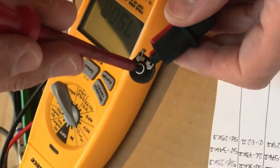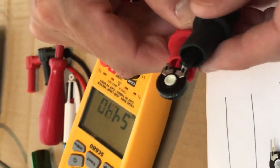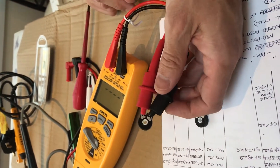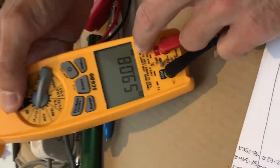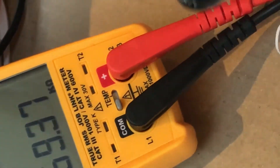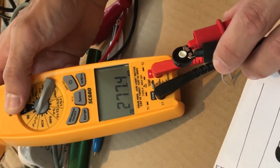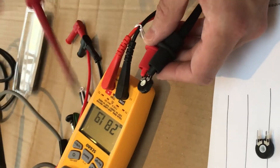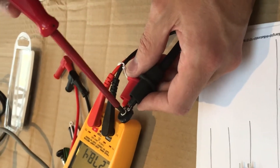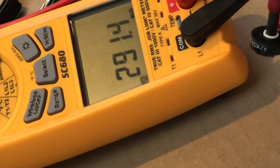I'm going to move it around a bit. First of all, we'll have a look at what we get from A to E — this should be a fixed resistance of about 47K. We've actually got 59K — you can see that, 59K there — that's across from A to E. Now the tolerance of the new one is 20%, which means you can go up to 56K. This thing's jumping all over the place, which is part of the problem. If I adjust the slider it shouldn't make any difference to the resistance there; now we've got about 47K. So there's something very wrong with this.